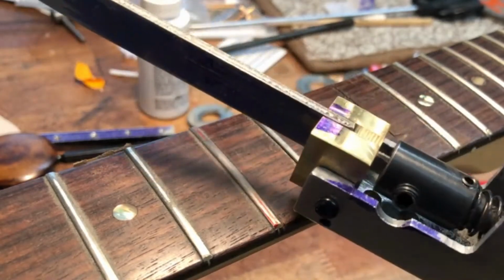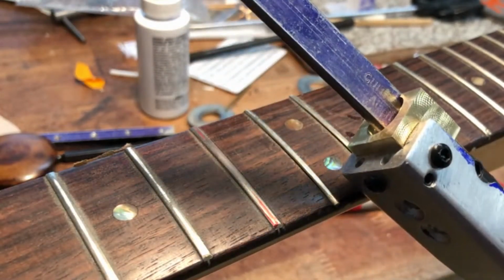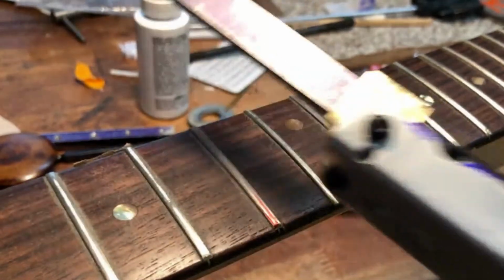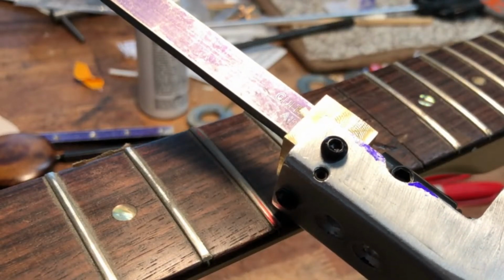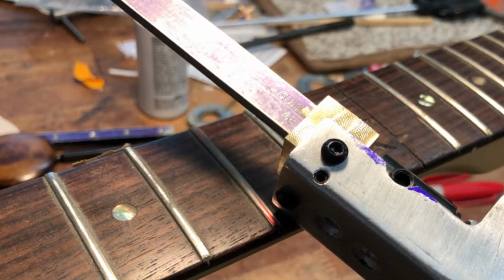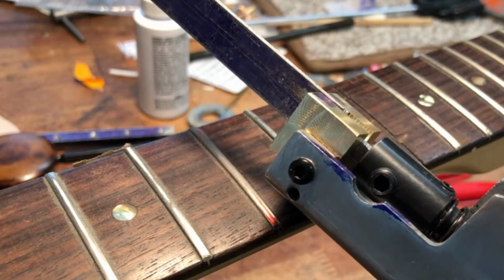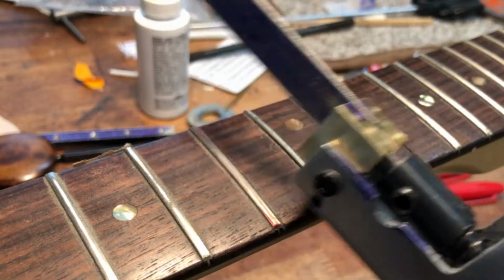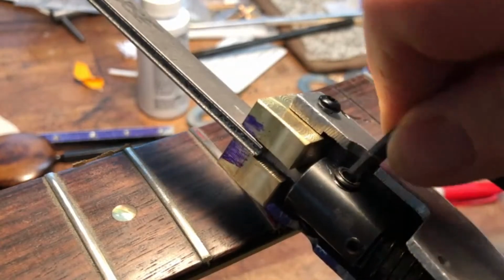You milled that brass block, which is U-shaped. Do you have any kind of lubricant in there, or are you just letting the brass do the work? No, it doesn't. But I've got some threaded nylon inserts coming, 5/16-18, and the next block will have a tap, and it'll have nylon set screws. That's cool, man. I can take this apart. No, I think we'll leave it together.